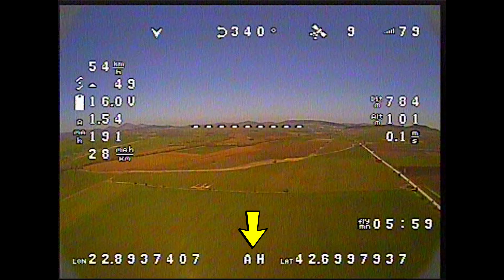I will install the RadioLink Mini Pix I have and see how that fares. Out of experience I can trust a Pixhawk to have reliable return-to-home and not to disarm itself in flight, which will give me the peace of mind needed to actually go out and do a long-range test of the XM+ receiver. First on the surgical table for a Pixhawk install is the Believer, but the Nano Talon would follow shortly. At that point I will also try to eliminate or at least limit the amount of slop in the Nano Talon's control surfaces and see how much that helps with the wobbles.